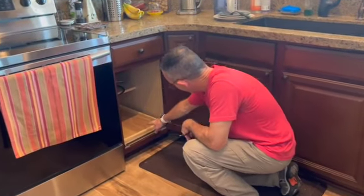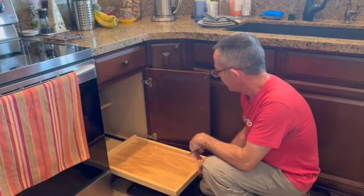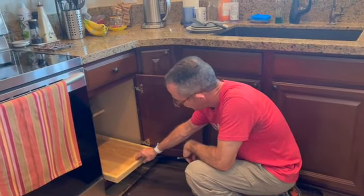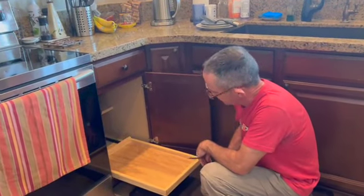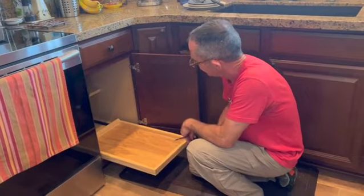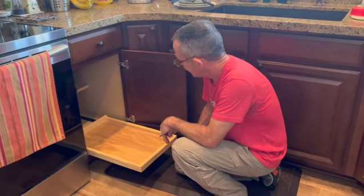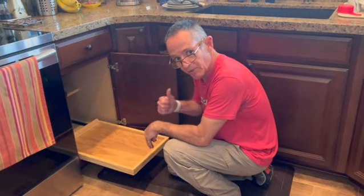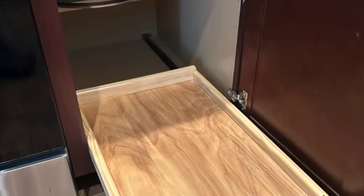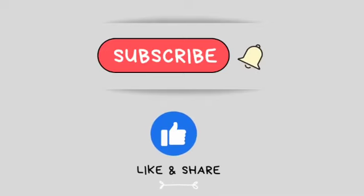Good news is we got the drawer back on and our slide misses the hinge, so that's excellent news. Again this is kind of the finished product. I'm not super happy with these rollers — you can almost feel metal on metal. So I think next time I need to do a little bit more research online and get some better rollers. But at least this is a good first start. We'll load her up and hopefully everything fits. Thanks for watching — if you enjoyed this video please hit like below, give us a big thumbs up, and don't forget to subscribe.